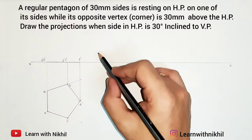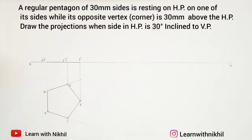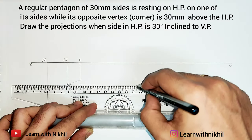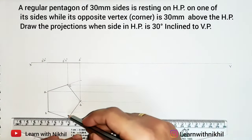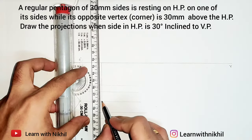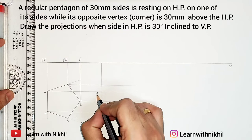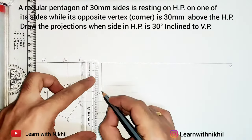After drawing this, one of its vertices is 30 millimeters above the horizontal plane. So this height is 30 millimeters. Point D will be upwards at a height of 30 millimeters. I will take the projections from here on the right side — take the point projection of the pentagon to the right. On this second step, D is above 30 millimeters, so this will be point A, B will be on the base, and D is upwards at a height of 30 millimeters.